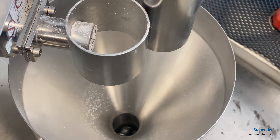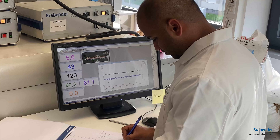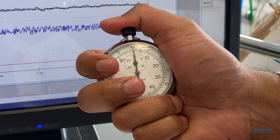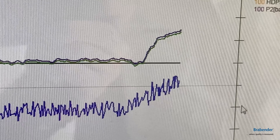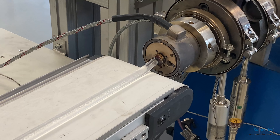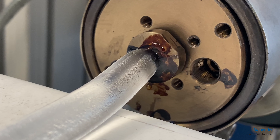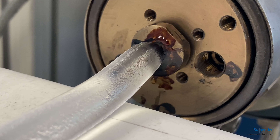But in this thesis, I am offering an idea where we are using pressure rise at the outlet as a parameter to measure the residence time. We will introduce polymer HDPE and start measuring the time from the introduction of the HDPE until the time where the pressure rises and it peaks at a certain level.